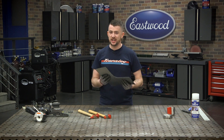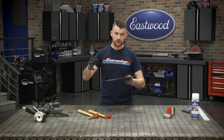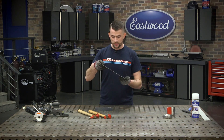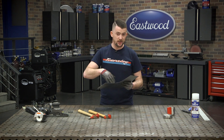Usually it's like 19 gauge, 18 gauge, even 20 gauge. The issue is when you weld it, the heat causes expansion, and then when it cools, it shrinks to a smaller surface area than it was originally. And that's what the warpage is that you're seeing. Now to eliminate that, today I'm going to show you my process to planish out this warpage.